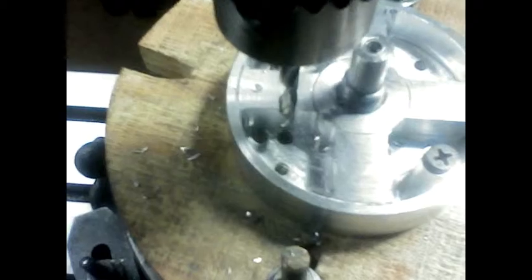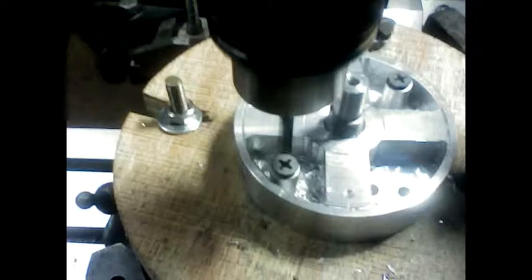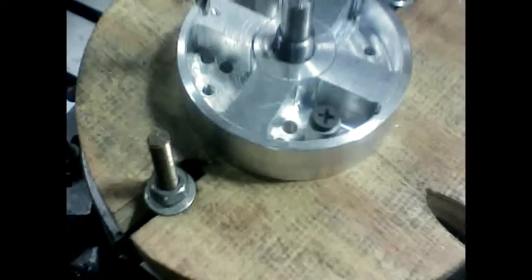I'm going to turn the table to the other side. Now I'll mill across there. Okay, so now I'll turn the rotary table 90 degrees, and then another 90 degrees, and just keep on going in that direction and getting all this done. Okay, 90 degrees, we'll take it in this direction, down to 270, right there. Okay, that takes care of the four quadrants on the one side here, all the holes every 90 degrees.